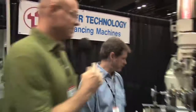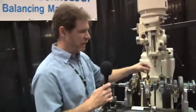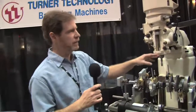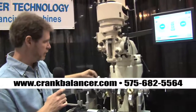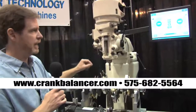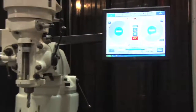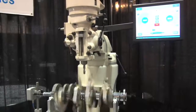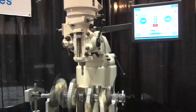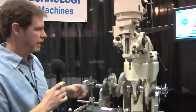Can you show us the machine on the mill here? We can just walk over and have a look at it. If you look at the software, it's showing a representation of the crankshaft as it rotates. To get a spin, on this model with a touch screen, you just touch the spin button. It will spin the crank up to the speed you have set — in this case, 500 RPM — and then it acquires the unbalance data and shuts down.